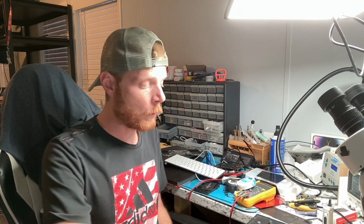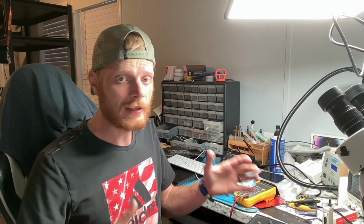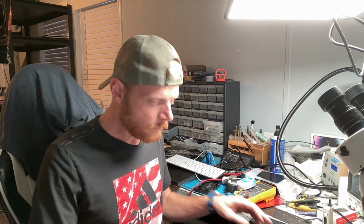This side is likely functioning. Now, it's still not gonna jump up to the 20 volt mark and start booting, because it needs all four CD3215s to work properly in order for the board to turn on and function, or to start charging, and really need to plug in the charger for it to start to run off the battery, so really for the board to function, right? So now that we know that one side is healthy, we're gonna swap to the other side and see what we get.